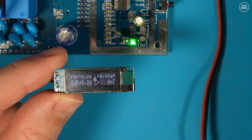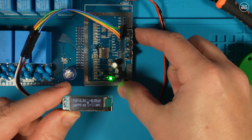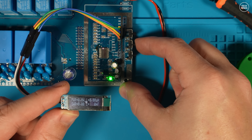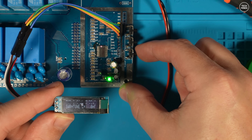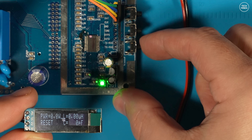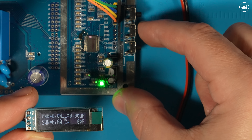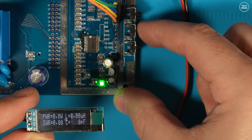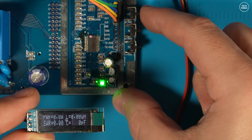The three buttons on the front edge of the PCB are for resetting, bypass, and enabling auto mode. We want to make sure the ATU is in auto mode. Luckily the tuner will remain in auto mode even after disconnecting and reapplying power, which means we do not need any external switches on the main box — that's one less hole to make and one less area where water can get in.